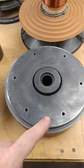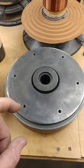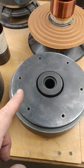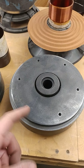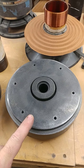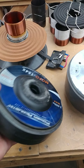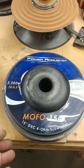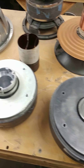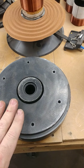This one uses the standard 2 and 3/8-inch coil, and because of the physical parameters of the coil, it's used by several other companies including the MTX 7500 and Power Acoustic. It uses it on their old T7, which is really great, and this is identical to the T7 motor from Soundstream. It's also used by Power Acoustic, which is owned by Epsilon. When you flip this over, it's the MoFo — everybody's hated woofer. Does it do 3,000 watt max? No, it doesn't. It does about 950 RMS, which is actually still much greater than this one, which is rated about 600 watts, maybe 650 or 750.